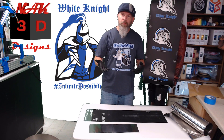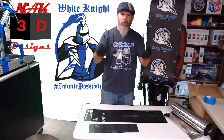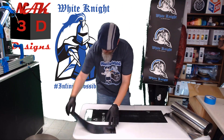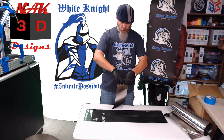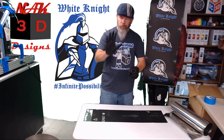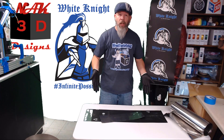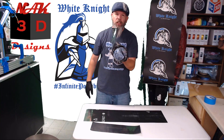I looked at what's currently in the market, and flex plate systems seem to be at the top of the food chain right now. What are they? They're a hardened stainless steel flex plate with some sort of adhesive covering put on. You can bend them nicely around. Prints will pop off, and you have to lay them flat again. So what's the difference between stainless steels? This is hardened stainless steel. You can carefully roll it up — these do have sharp edges, so be careful, it's why I'm wearing gloves — and yet they will lay back flat again.